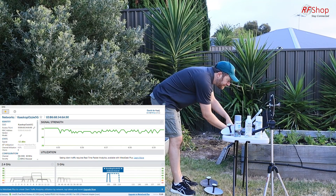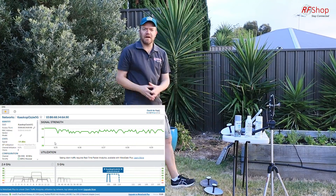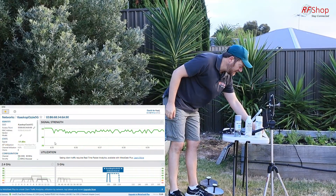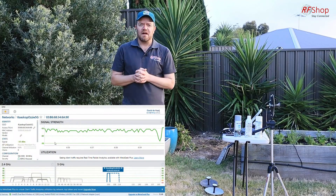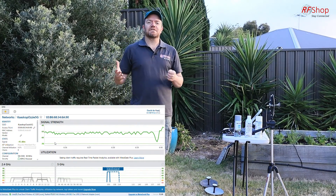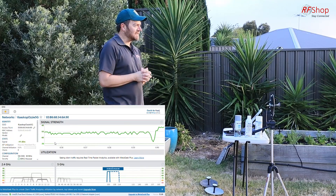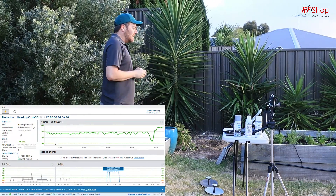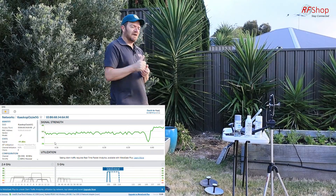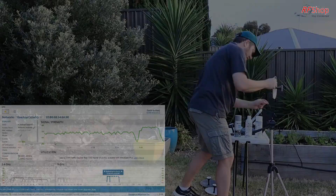The system is up and running. The signal strength is reading at minus 54 — that's through a dipole. First test: I'm just going to swap it with the antenna that has the aluminium tape. This is at 5.8 GHz. The antenna can do 2.4 and 5.8 — it actually works from 2.2 GHz up to 7 GHz. The whole design is designed for Wi-Fi 6E and everything still to come. Testing 5.8 is useful because you already get a lot of losses over the distance I'm looking at. The aluminium tape dish is working — it is showing a signal going in that direction. It's a better antenna than a dipole, as we've seen before. Aluminium tape works and that's my starting point.